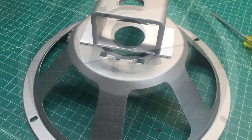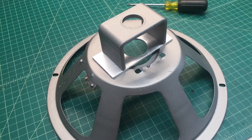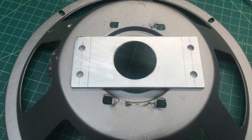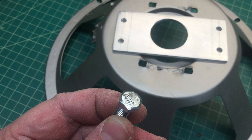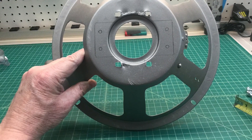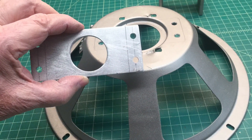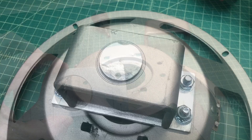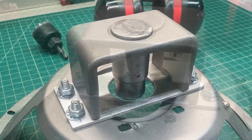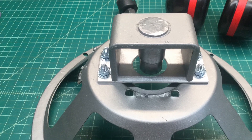The secret sauce here will be how to align the center pole piece back on the speaker frame so it's in the middle of the speaker. After fabricating the base plate, it's time for a dry run — you can see I'm laying it across the existing holes in the speaker frame. There was a little unlevelness, so I wanted to make sure I had a nice level surface. You can see I'm selecting hardware: washer, lock washer, and a little thread locker. I'm drawing out around the bottom plate where I'll drill holes to attach the new bottom plate. Nothing's tightened down yet — everything is placed just to make sure it fits before I snug everything down.